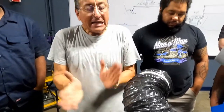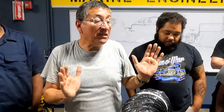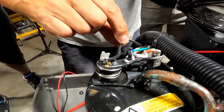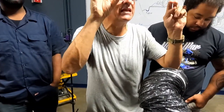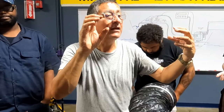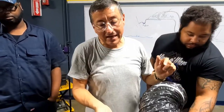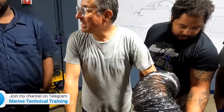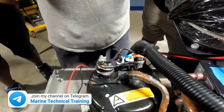Right now the unit is running. The unit will stop only when the thermostat disconnects the main power. When both temperatures are equal — the temperature I want and the temperature I have — the thermostat sends the signal and disconnects power, and the unit stops.